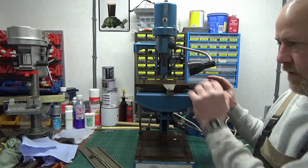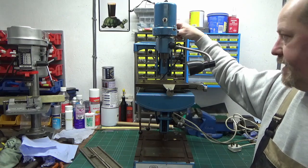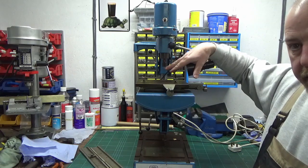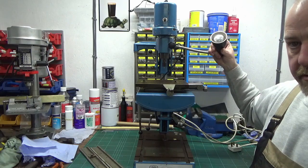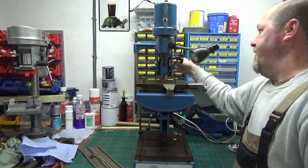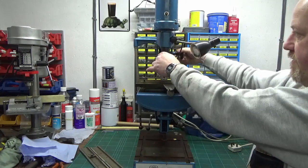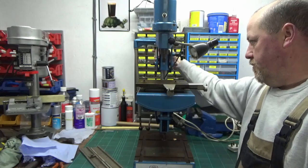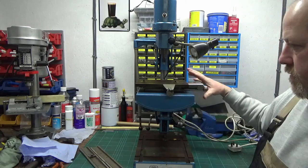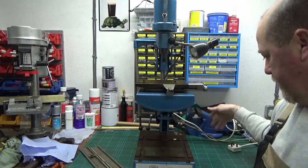From your original copy or pattern on this bottom face, you have a reduction factor you can alter, which controls the amount of movement on the table surface at the top - that controls the size of your actual engraving. There's X and Y positioning on the table, an electric motor, and at the back here you've got almost a rack and pinion arrangement where you can lift the head up and move it to different positions. The table is also on a rack and pinion.